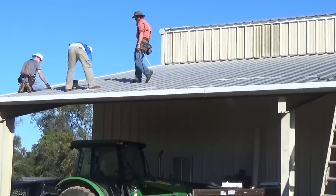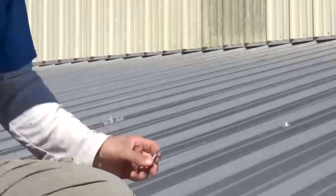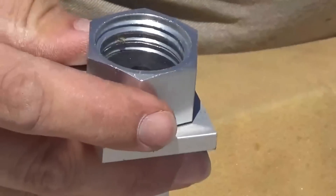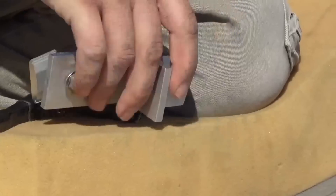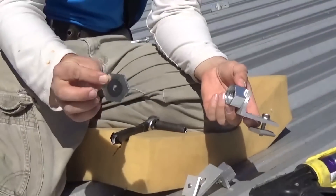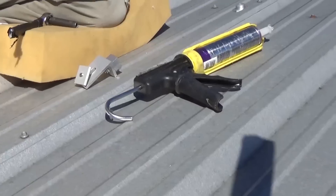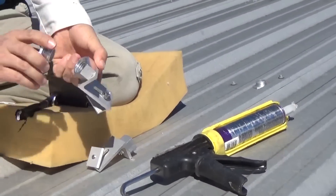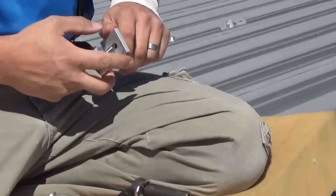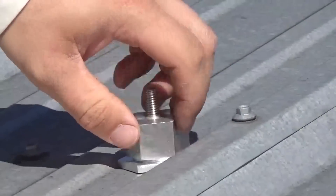Johnny Valentine tells us about the Snap and Rack roof base. It's got a nice EPDM gasket specifically designed for metal buildings — like a red steel building with a Z purlin. That's what we have here. That's the actual base that gets screwed down where the Z purlin is. After you get your base down, you come back and tighten it up — it's got another gasket in there. The top of the base is a half-inch stud, so once it's on, you can attach pretty much anything — satellite dishes, all kinds of stuff.